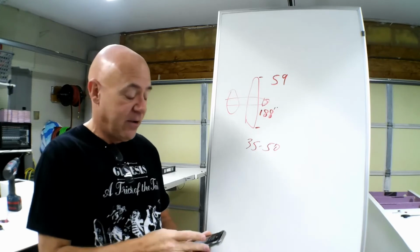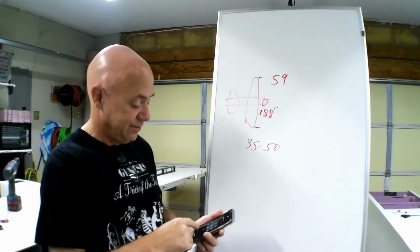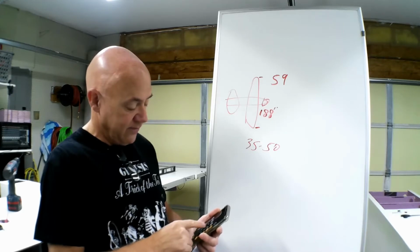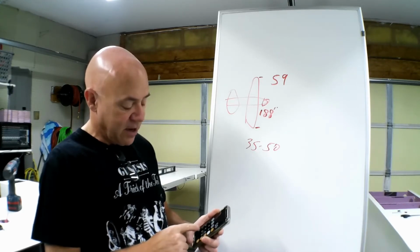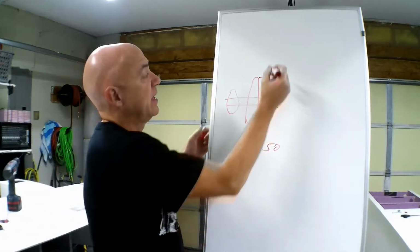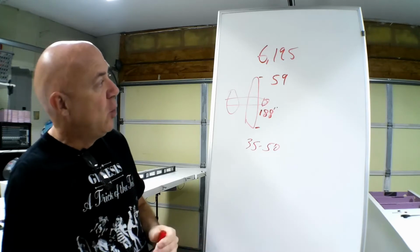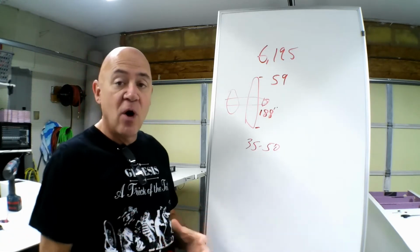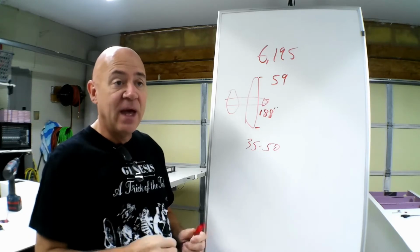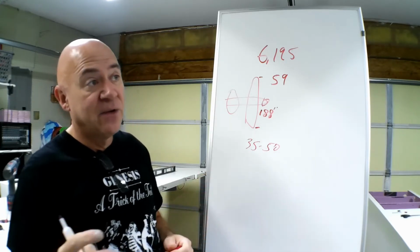And the way it ended up, once I did my reverse math, was, hang on a minute, I want to do this factually for you guys. I would take my 59 and multiply it by, let's say, 105 watts a pound. That told me I needed around 6,195 watts. So I would go online and find a motor. I happen to already own a Hacker A100, which is 150 kV, and it's basically a 7,000 watt max motor. So I knew I had a motor that could carry enough watts.